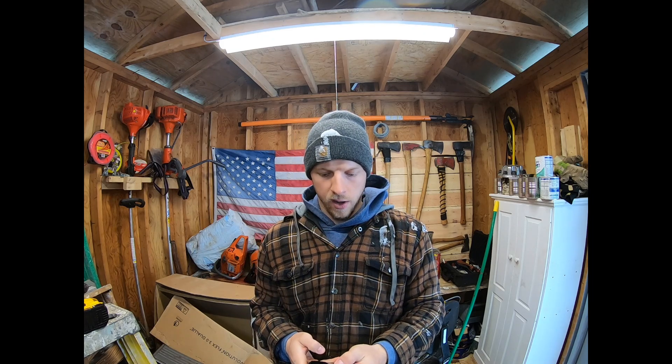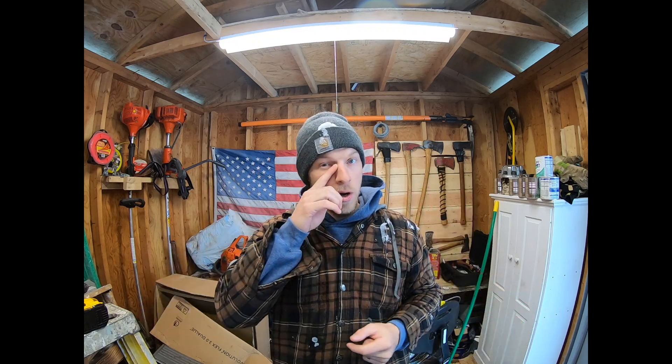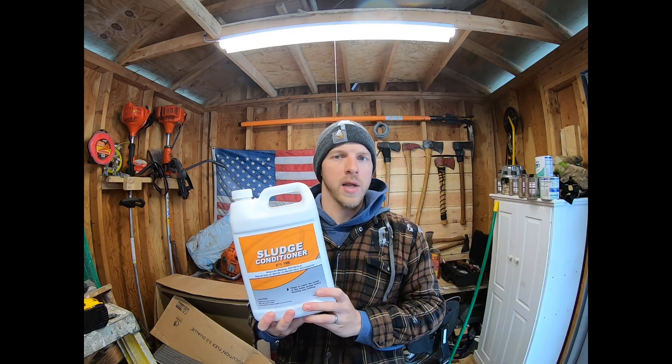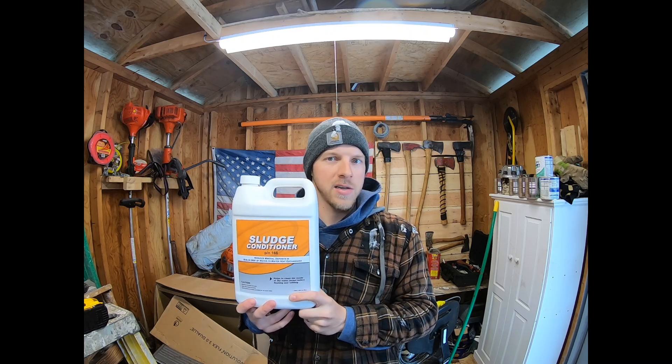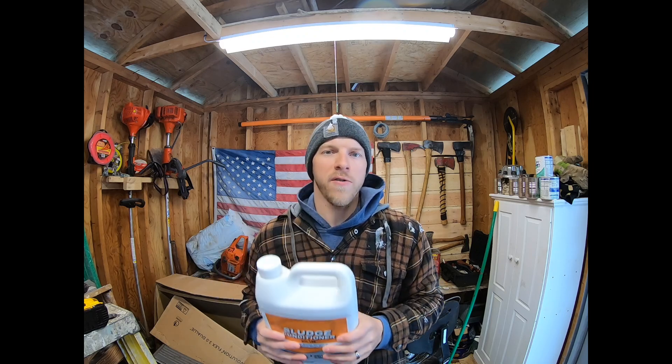Right from Central Boiler, from an email: the sludge conditioner will work at any temperature, perhaps better if the water is above 160 degrees — particularly if there is a lot of rust or sediment attached to the surfaces. So we are going to fire our machine back up, get the temperature to 180 degrees, and run it for six days. My machine is a 393-gallon capacity, so one gallon is enough. If you put this in, you need to commit to draining and flushing — if you leave it, it can have the opposite effect and cause damage.